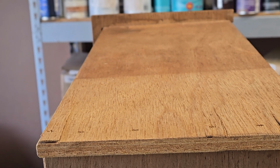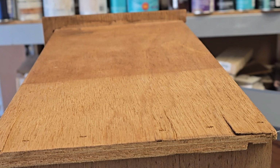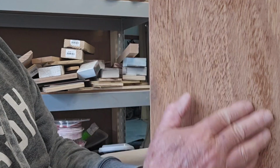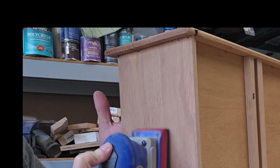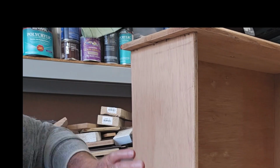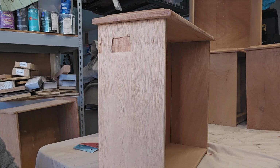They were very rough, they were coming apart in places where these were plywood sides and the wood was lifting up. There were places where there were gouges and had to be patched with wood filler. And so what I needed to do was to fix these drawer boxes and cover that wood filler so that they looked like they should have looked like in the first place. I did this using a paint wash and a golden oak stain.